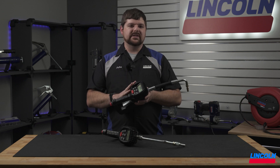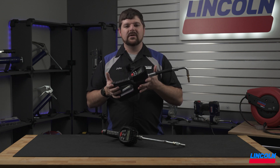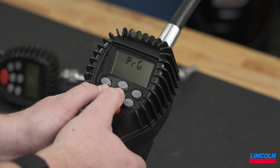These meters may require changes to the dispensing unit measure and scale factor calibration to accurately dispense the given fluid for its pump setup. Enter the programming screen by pressing and holding both the total and auto buttons until PRG appears on the display.